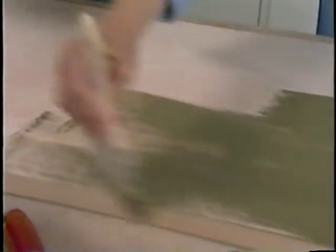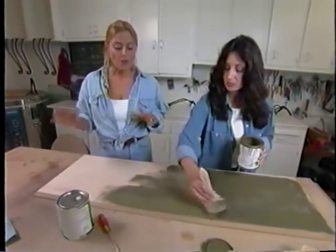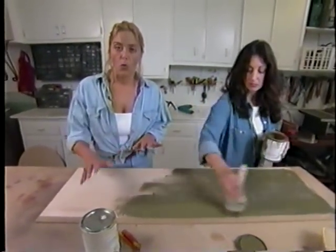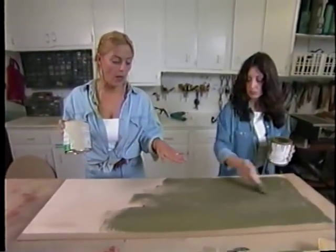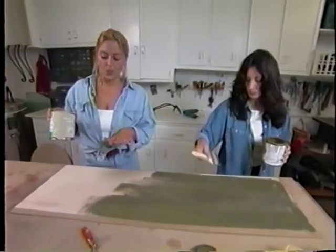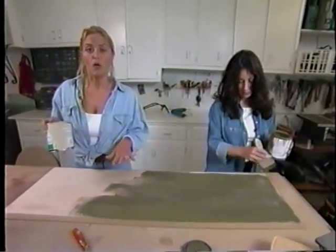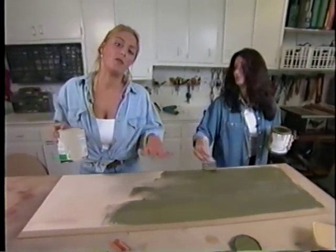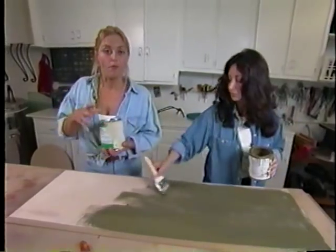So we're going to go ahead and just quickly coat this — we just want to make sure you get adequate coverage. Now, after the green paint dries, you're going to put a coat of off-white paint right over the green paint. The reason why we do that is because we're going to sand this afterwards and try to get some of the green paint to show through. Most older pieces have been painted several times, and it gives the piece a real feel of originality.